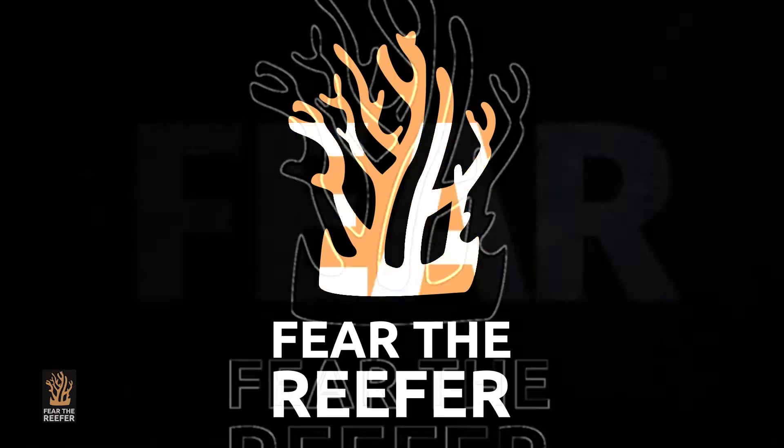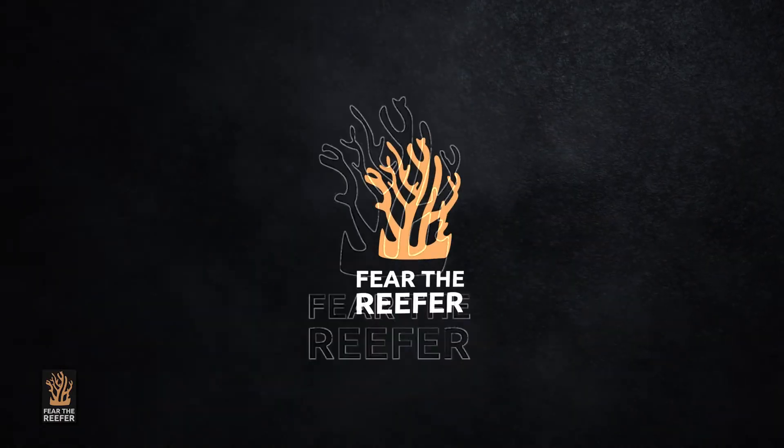This is the crawl space into my house. Anytime you're talking about putting a literal ton on your floor, you need to make sure you can actually withstand the weight. I've consulted with an engineer to make sure my floor is structurally sound and can withstand the full weight of the 220-gallon aquarium. When you factor in the rocks, the water — which is eight pounds per gallon — 220-ish gallons, you're probably around 2,500 pounds.